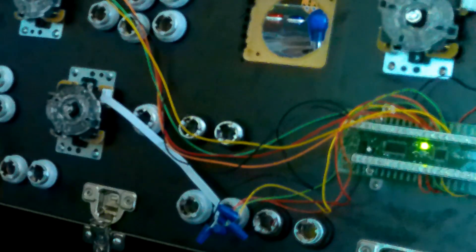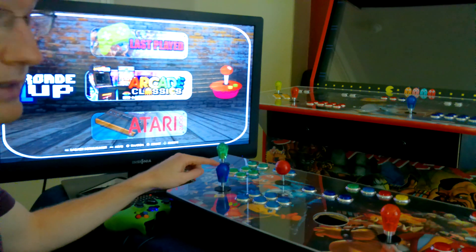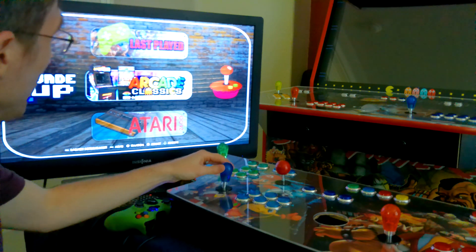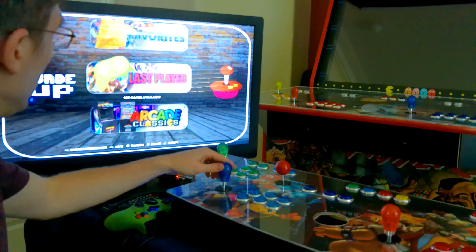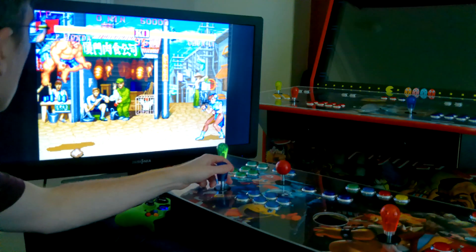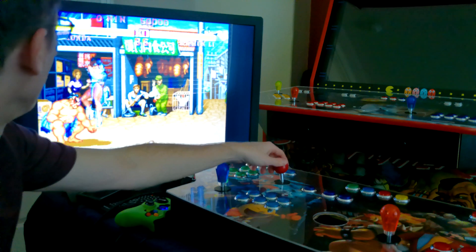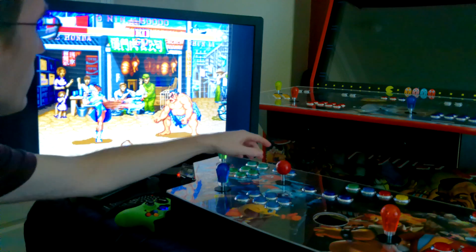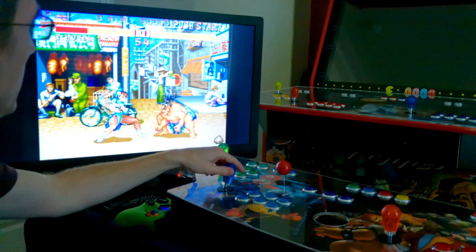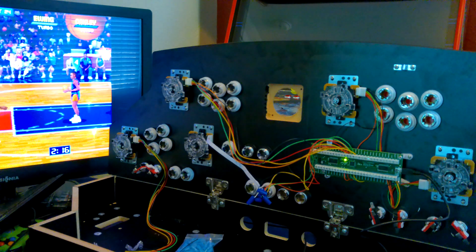So now that this is up we know this one works. Does this Player 1 button controller work? Let's see — up, it went up; it goes down. It's working. He does jump forwards and back — see that. But here it only jumps up because it doesn't have the diagonal, so the four-way joystick is working. This will be great for Pac-Man, Dig Dug kind of games. But here you can see it's an eight-way so you can go diagonal.